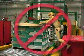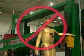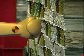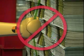Never straighten or stabilize a load as it's riding into the machine. Never service, clean, or lean on the machine when the power is on. Do not change the preset logic in the programmable logic controller. Doing so could cause serious personal injury or machine damage. Never lift or pull a load by its strapping. This is a dangerous practice which could result in serious personal injury.